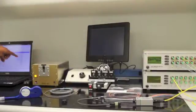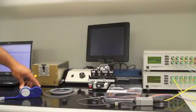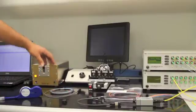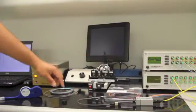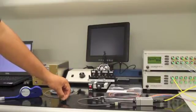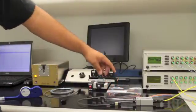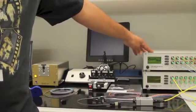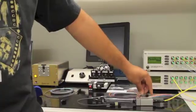You'd be utilizing your laptop, your standard MTP cleaner, the test cable you will be testing, a standalone scope, your MTP to MTP mating adapter, your HPR MTP reference cable, your OP930 multi-mode switch unit, and your RIN10 power meter.